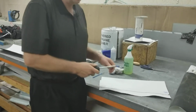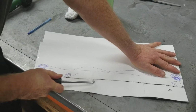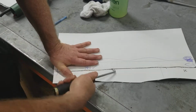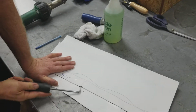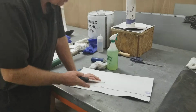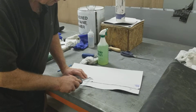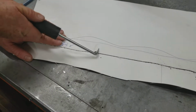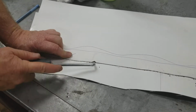But if I probe aggressively, at that angle, and I actually apply some pressure, I found a little spot that hung a little bit right there, so I'm going to dig in that a little bit. You can sort of see that if you start pushing into that sheet, and it was really welded, you're going to damage it, because you're just going to get in a little bit and say, well, it really wasn't a weld, but I just messed it up. But this was a spot where I did a stop, and you can see that based on this line right there in the membrane. That's where I was welding, and I stopped at this point. And my deficiency was I didn't wait for the heat long enough before I got started again.